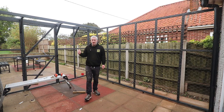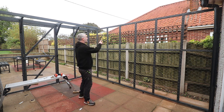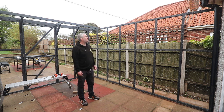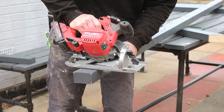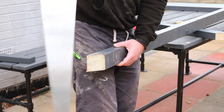With the roof structure complete on the first wall, the second wall is going to be difficult for two reasons. Firstly there's a downpipe in the way at the end, which means I can't build the frame on the floor and lift it up like the first one. Secondly the span here is just over 3 metres - about 3.3 metres - and all my timber is 3 metres in length. This might be an opportunity to cut my first ever scarf joint. For now I'll get the parts I can built, and worry about that 3.3 metre span later. The first beam will sit on top of the wall plate and be fully supported, so I'm cutting a 45 on the end to splice a shorter piece on to give me the extra length needed.